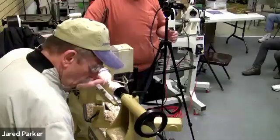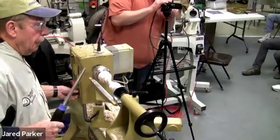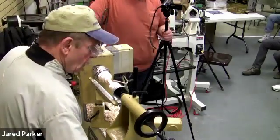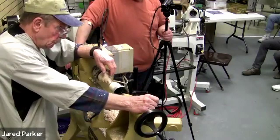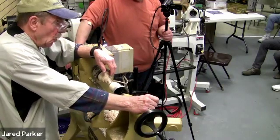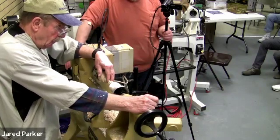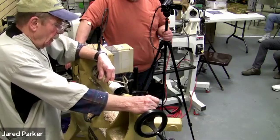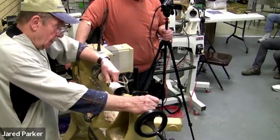Usually, I may as well finish this rascal. Robert, yes, sir. So to get different size rings on there, by not bringing the extra wood down so small. Is that correct? Correct, yes. Get your cylinder the size you want the ring, and then you cut the ring, and then clean up what's left on there after the ring comes off.